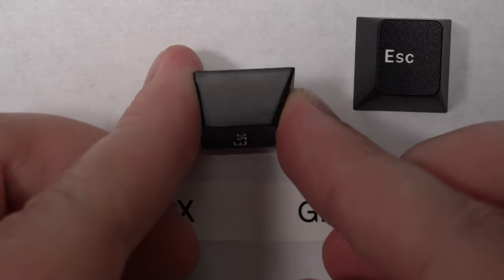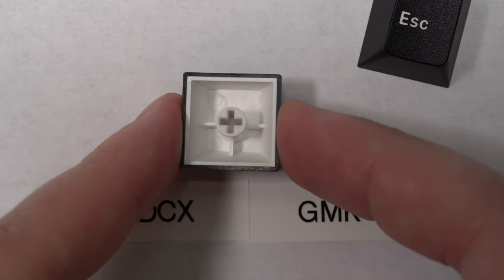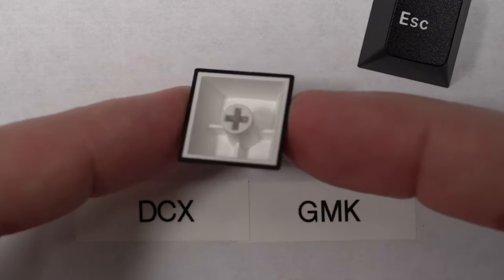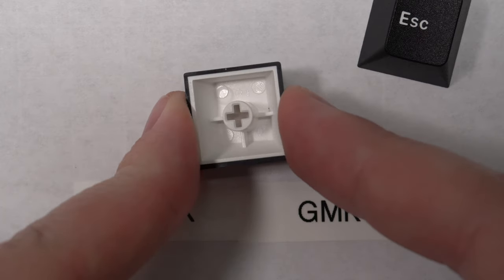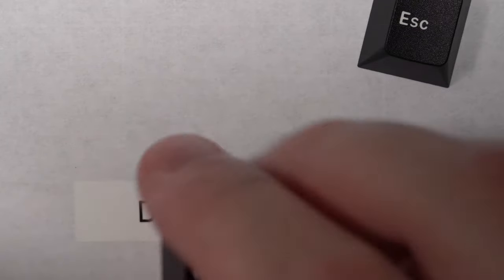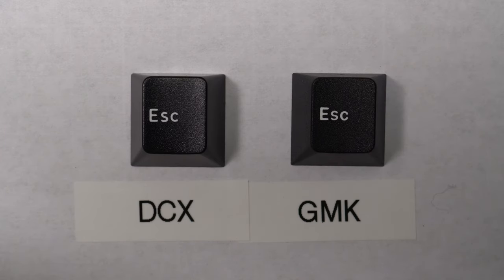So, on DCX, there are no visible sprue marks on the customer-facing, yes, even the back, sides of the keycap, and of course, especially on the top. They designed all their molds so that all the sprue marks are on the bottom. Let's see, we got one right top center there. That might actually be the only one for the black plastic. And then those are actually probably ejector marks, the 4 white circles we're seeing there. I'm betting that's not, it might be sprue. They might be ejector marks. But regardless, on point 4, Drop nailed it. You can't see any tool marks on the outside. GMK put them, well, Cherry before them, and then GMK put them in a place where you can't see them. But point in Drop's favor.